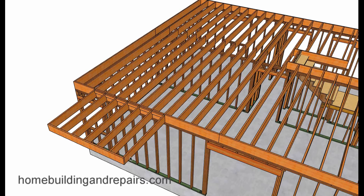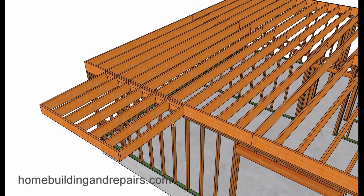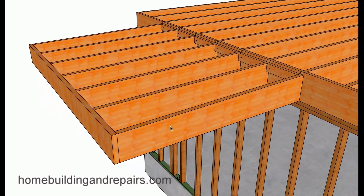Now the size of the joists I can't provide for every situation. Working out here in Southern California we use two-by-twelves, and they would rip them down to about six-foot balconies and they seem to work. But with snow loads and other factors, you might need a different system.